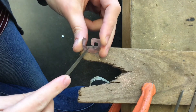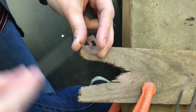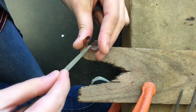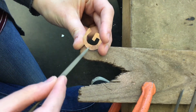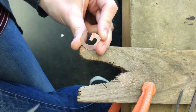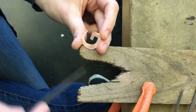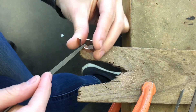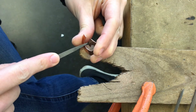Once I have any really big bumps removed, I can continue with a much broader stroke. I want to create a really nice smooth flowing curve, and to do that I want to cover as much surface area as possible in one stroke — that really helps level everything out. So I'm going to use more of a diagonal motion, starting at the tip of my file.